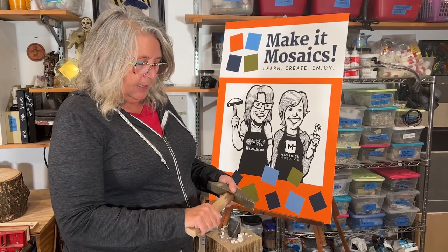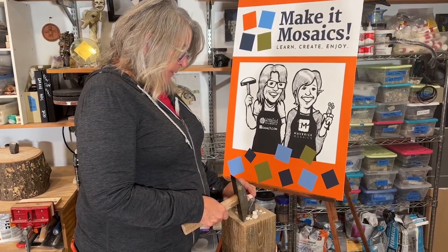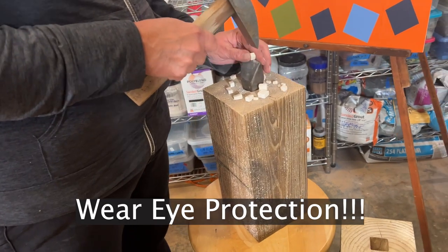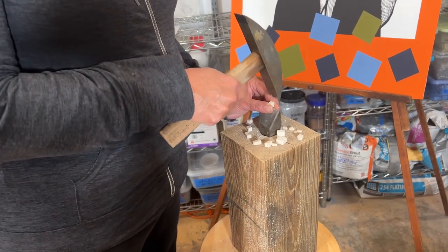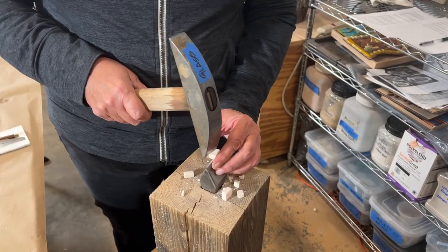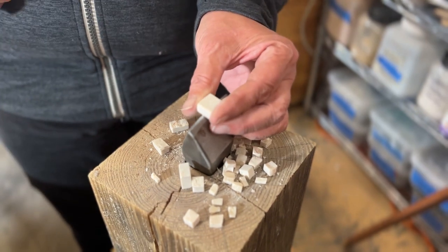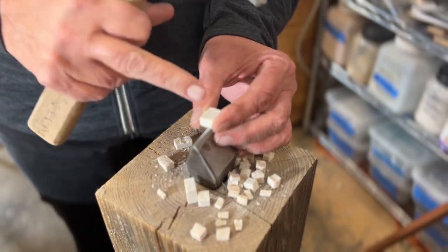It's not on the end of the hammer — it's more of a middle grip. You'll find your correct balance, and we don't want to wag it. This is really a wrist action, not chopping wood. Let the hammer do the work. So regardless of whether you're standing or sitting, when you're holding your material you're putting your cut line over the top of the hardy.